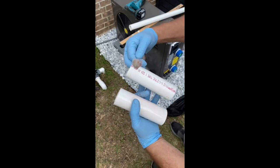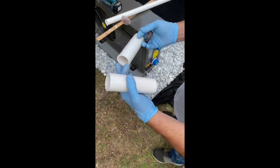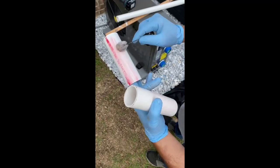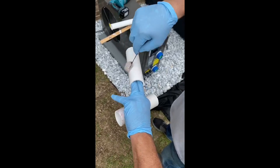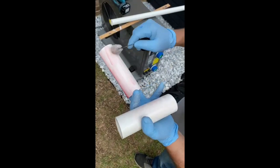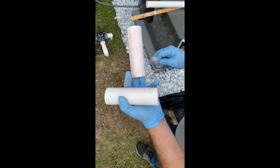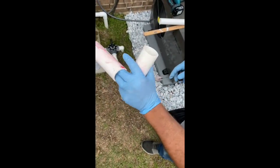These are two six-inch pieces which will go into the heater. No matter what you do, you have to use at least six inches straight before you make any turns. We need to clean the outsides completely with pipe cleaner or acetone, because sometimes when these pipes come out of the factory they're very glossy and slip from the gaskets. By doing this, we take that sheen off the surface so it grabs onto the gaskets much better. Just do it like this and let it dry for about a minute, then we'll start using them.